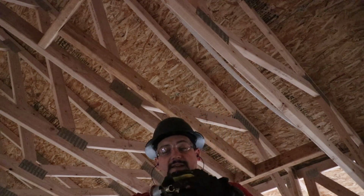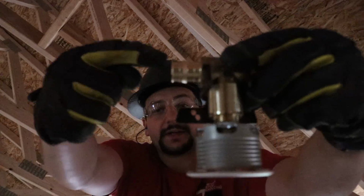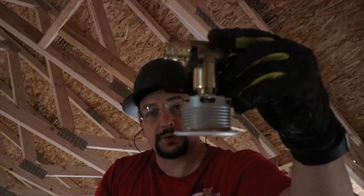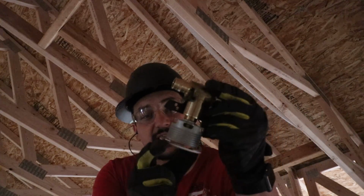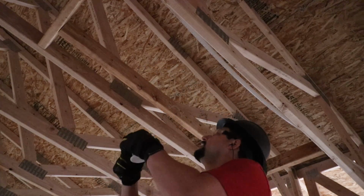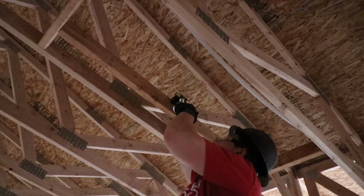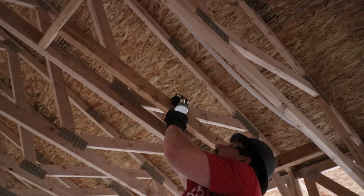So what I've done is I've taken the assembly and assembled it. So I have my T-assembly, my bracket installed, the sprinkler head, and the cover plate all put together very lightly, not even hand tight, just till they barely snug up. Once I've got that assembly done, I can hold it up here in place and determine the height it needs to be at in order to have the sprinkler head in the correct position when the sheetrock's installed. Grab the drill.